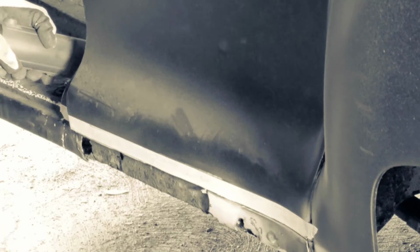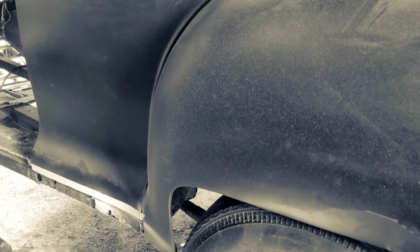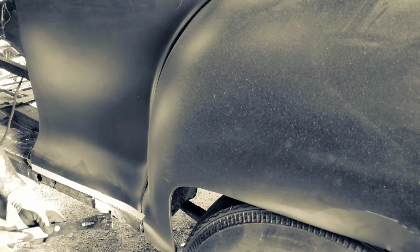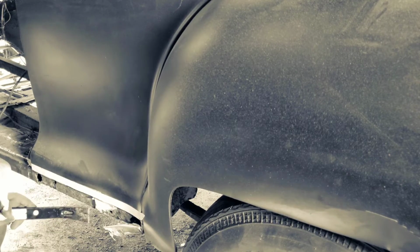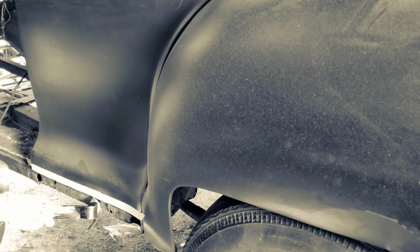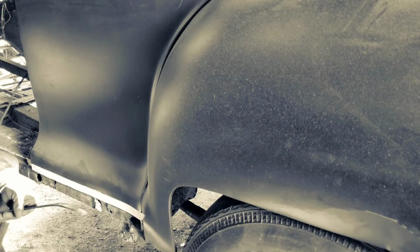I get a little excessive sometimes with painting over my projects right away, right after I weld them. And then I have to go back and grind the paint back off if I weld anything onto that. But better safe than sorry. I just don't like to wire off rust all the time. After about a week of touching the material, you're gonna start seeing surface rust if you're touching it with your hands. And that started happening to the brand new square tubing I had already, so I just paint over it. I don't mind grinding it off real quick. It's not a big deal to me. Yeah, it's all Bondo. And then in behind is just nothingness.